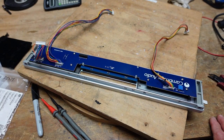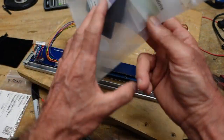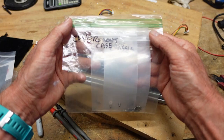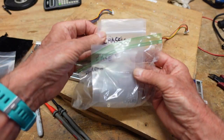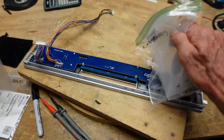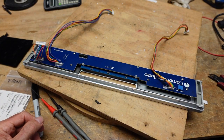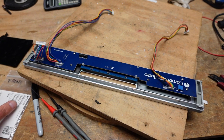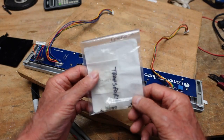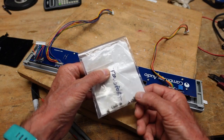I want to talk a little bit about the system I use. Anyone that's watched my channel knows I create a large bag to put all the parts in. Each bag inside has all the different parts — this is from the cover, individual bags for the screws that came out of the chassis that held the cover on, the ones from the back, the ones from the front. When I go to put things together, I no longer seem to have leftover parts, and I know where everything goes because all the bags are marked. These shorter screws held the transport in place, different from the other panhead screws that held the rest of the cover on.